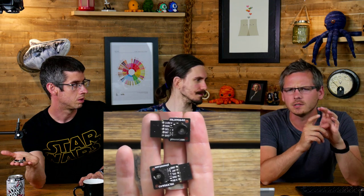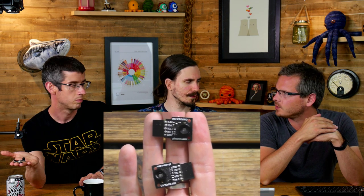Very good for making a heat-seeking robot, like chase your cat around the house or something. That would be awesome. A cat-seeking robot. Yeah, they're cool sensors. There are quite a few of these sensors out there already that are much lower resolution, like 8x8s and even 8x1s. But these are quite a new part, and 32 by 24 is really good.